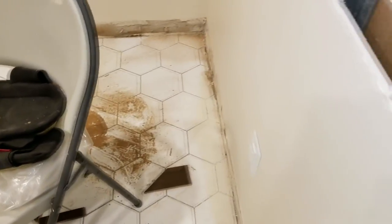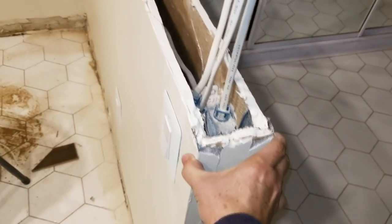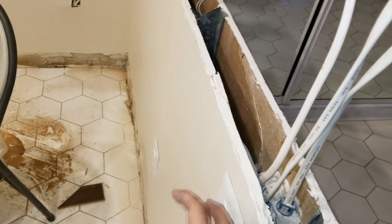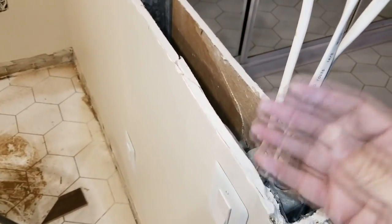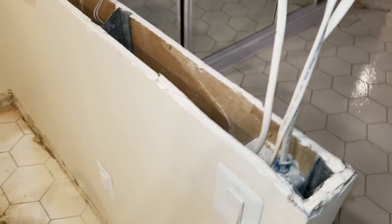This part of the wall is wobbling - you can see really bad how much it wobbles. There's not much support in it, and this is what happens when you have a wall that comes out this far with only metal studs. Metal studs are good and strong, but they're very bad for torsional strength. They twist easily - they're not like solid wood. And even if you had solid wood here, this wall would still be wobbly because there's nothing to stop the left-to-right direction.